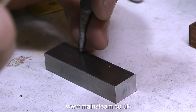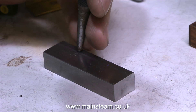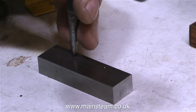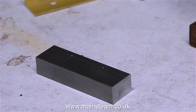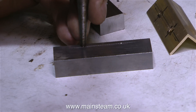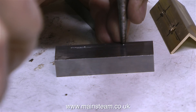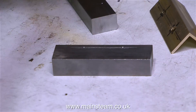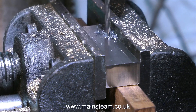A centre punch is a really useful workshop tool, but like most workshop tools, you need to practice with it. You might think it's as simple as just hitting it with a hammer — it's not really like that. First, you tap it very gently, then have a close look, under a magnifying glass if necessary, to make sure the centre punch mark is precisely in the right place. If it isn't, because you haven't punched it very deeply, you can correct it by tipping the centre punch and hammering at an angle. Once you're happy the mark is in the correct place, hit it with a bit more force to make an indentation that becomes a guide for the twist drill.